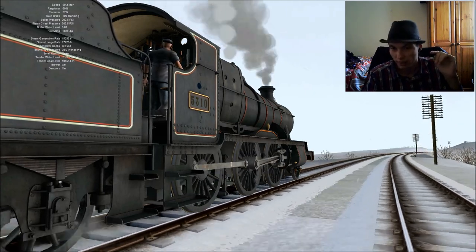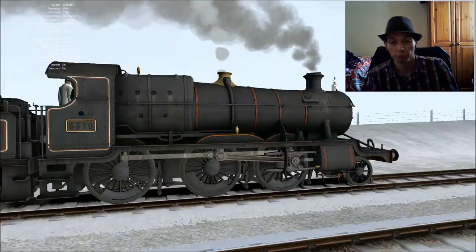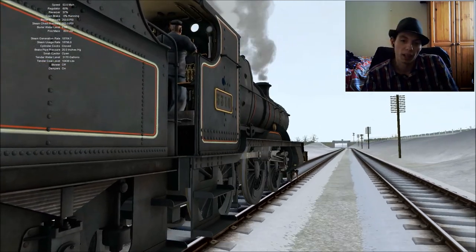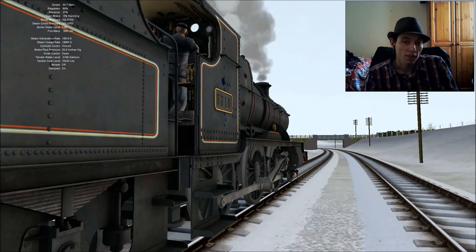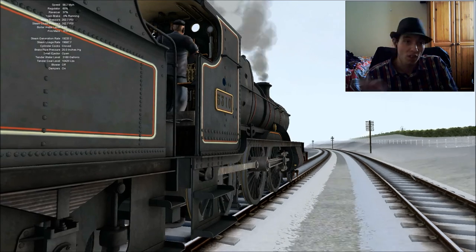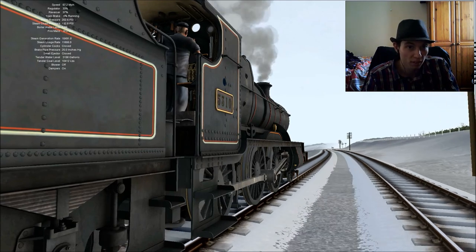Great Western engines, I mean, if you hear that sort of noise as we're going along, Great Western locomotives have a vacuum pump, which I can't actually find on this, but there is a vacuum pump somewhere on this engine which is driven by the wheels. And when you drive some advanced Great Western locomotives, you'll actually find that the faster you go, the vacuum pump can keep on top of the brakes and keep a vacuum in the system, and so you end up with the brakes released, thus you don't require the ejector, and therefore you save steam, basically.